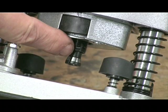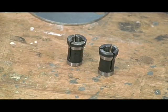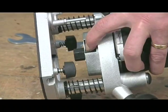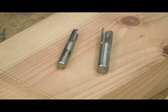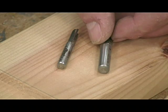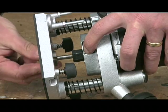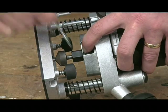The cutters are held in a collet in the main spindle, and you get three different diameters: 1/4 inch, 6mm and 8mm. In the UK, quarter inch shank cutters are probably the most used, but the more rigid 8mm versions are becoming more and more popular. Fitting the cutters can be a bit tricky on some routers, but it's no problem on the T4, thanks to the integral spindle lock, which means you only need one spanner to tighten or release the cutter.